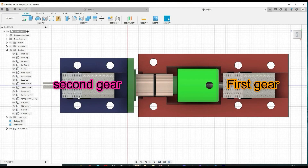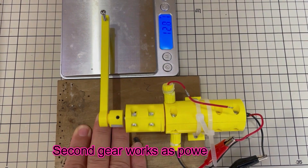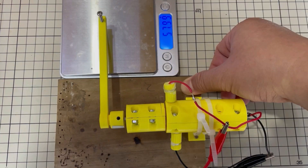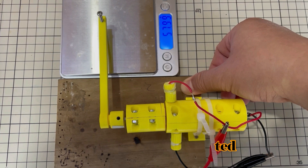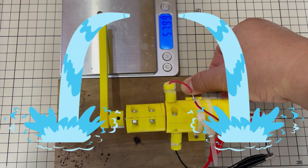Now I know — it may be caused by the serial configuration. When rotating, the second gear motor works as a power generator. It generates power against the first gear motor. To overcome this counter power, we need additional power, meaning half of the additional power is wasted just keeping the second motor rotating at the same speed.